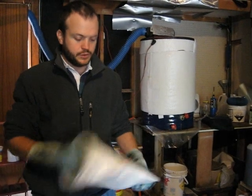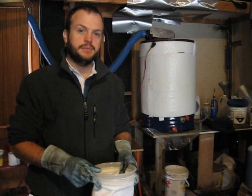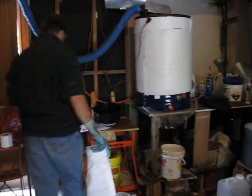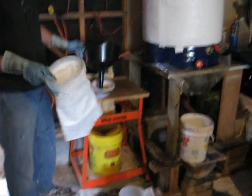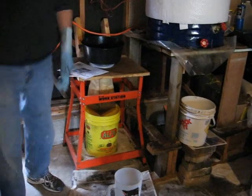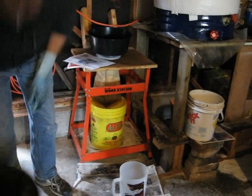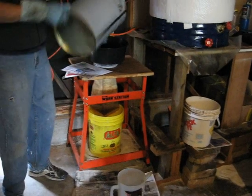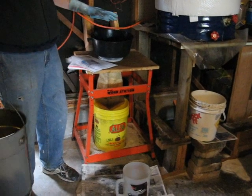These filter bags will hold quite a lot of oil inside, so when you use them inside your filter setup, you may as well make it gravity fed. Over here is my setup — it has a small workbench, and inside I have identical filter bags put in place. As you can see, it's discolored a bit because it's been used to filter oil. When you get your oil in pails from your restaurant, pour it into the top into the large funnel — it's a nice big target, and you want as big a target as possible.